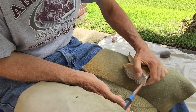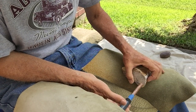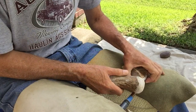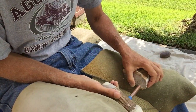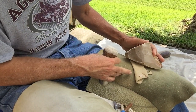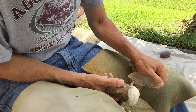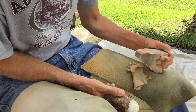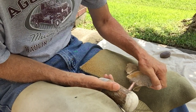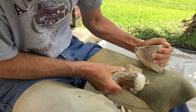One of the things that's cool about indirect is you don't actually have to support it underneath as much, and you don't have to support the back edge as much. It's good to do it anyway, but a cool thing about it is - if your workpiece will stand up to it - indirect is powerful enough and blows the flakes fast enough and initiates the cracks fast enough that support is less relevant. But it's still relevant - I'm not suggesting don't support your work. See, I'm not supporting it very well there and I've got a real steep platform and it isn't going.